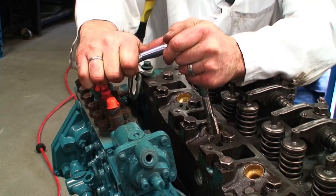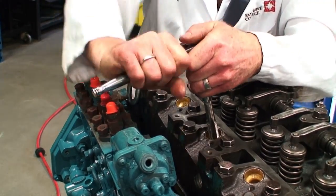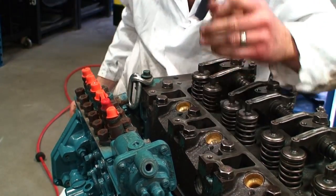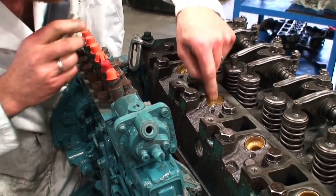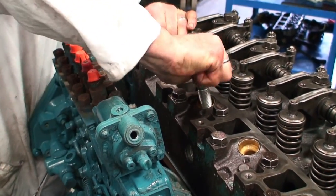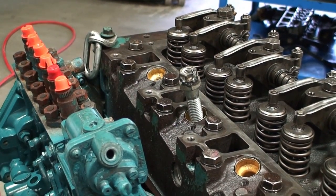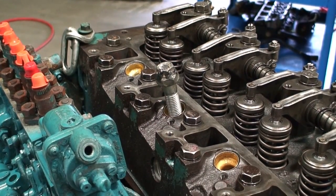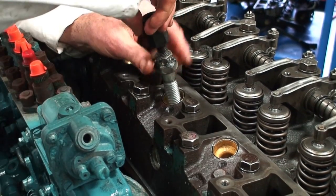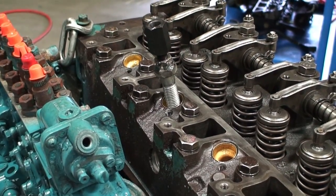You can see how much of a chore this could actually be when you're doing it in the chassis, because you probably have the cab in the way and so on. We've got enough material tapped in there now and there's lots of debris on top, so I'm going to wind this bolt down into position and snug it up. I just have to get it to start into that sleeve and then we're going to put a puller adapter onto it and install our puller.